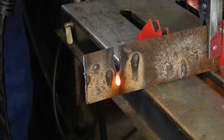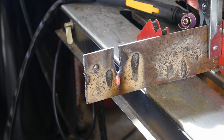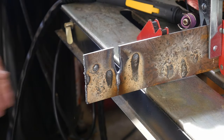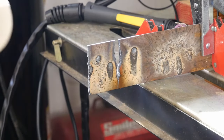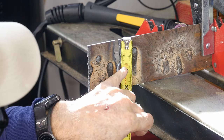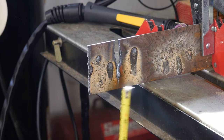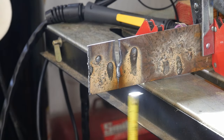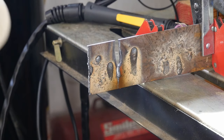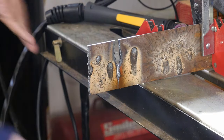That sucker went down through! I just wanted to give you a feel for how the plasma cutter can blast metal away, which is awesome. Let me measure it — it's almost exactly an inch and a half depth. I've cut half-inch metal with these plasma cutters before, and they're not rated for it, but as you can see you can sometimes sneak your way through. It might be a little messy and cut pretty wide open, not a beautiful straight line like a saw, but you can do it.